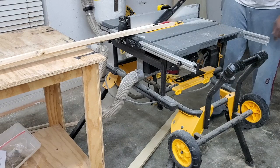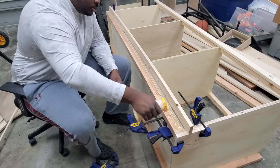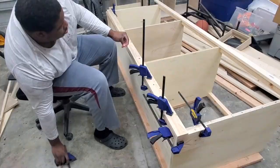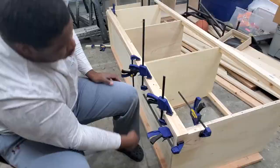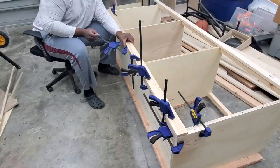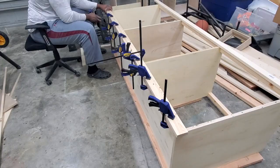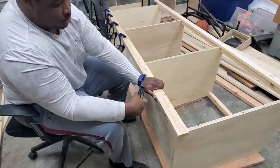To set up for the face frame I grab some 1x4s and cut them down to size — about one and a half inches. I'm going to attach this to the front using wood glue and brad nails. To give this TV stand a wraparound look, I clamped a scrap 1x4 to the side so I can get the exact length I would need for the overhang. Once I got the wood glue down, I use some clamps to make sure I can get everything aligned exactly the way I wanted it.